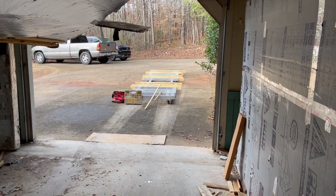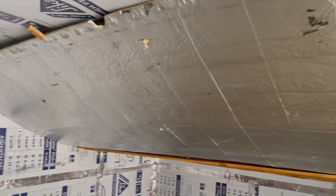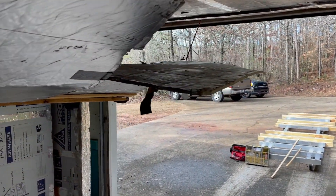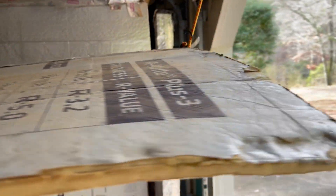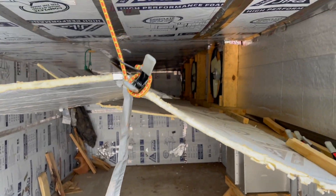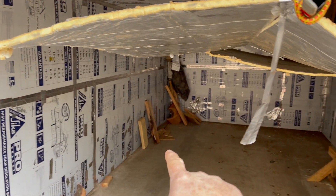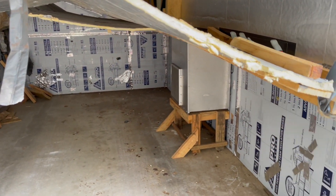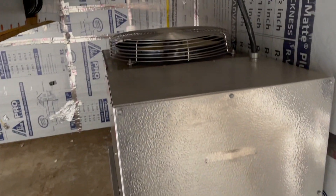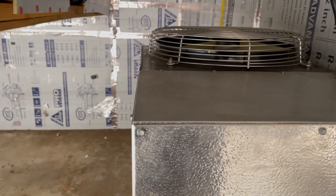These are my baffles — they're very inexpensive, just sheets of insulation I had left over. As you can see they've gotten beat up; this one I'm going to replace today. The reason you have baffles is they go down on the stack of wood, and then the fans blow the air — it bounces off the wall, comes through the stack of wood, and comes up through to the other side. This is what's called a dehumidification kiln.